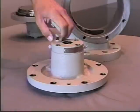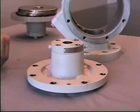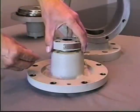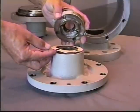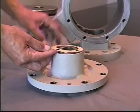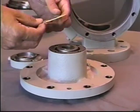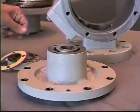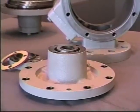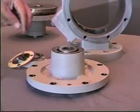And then the bearing cap will come off. You'll note colored shims. These shims are used for adjusting the thrust bearing clearance. Normally, you'll just replace the shims that came on the existing pump when you reassemble, keeping the same shims along to the same side. If you need to completely rebuild the pump and begin shimming over, we'll discuss that at a later point during the reassembly of the pump.